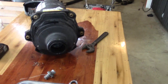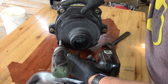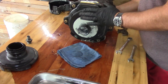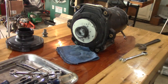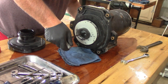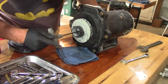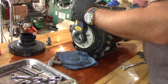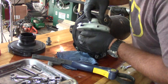Now the motor is disconnected from the pump, so I moved it up to a table where I can work with it. I'm taking off the electrical clamp — there are two Phillips head screws I'm removing, and that'll give me access to the impeller on the pump. By turning the motor upright, I can put a wrench on the back of the shaft for loosening the impeller. My old pool pump is an Emerson, and there's a hex head screw that is reverse-threaded, so I pulled that out before removing the impeller.